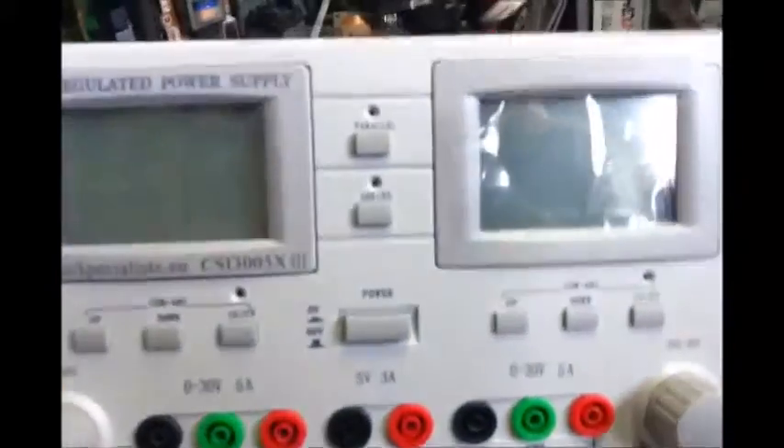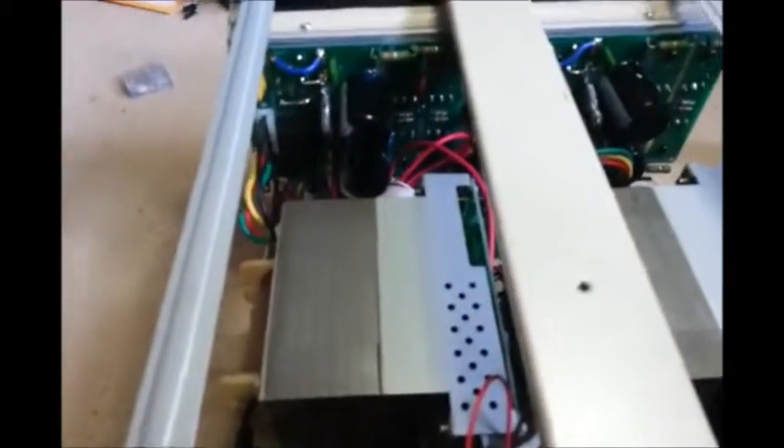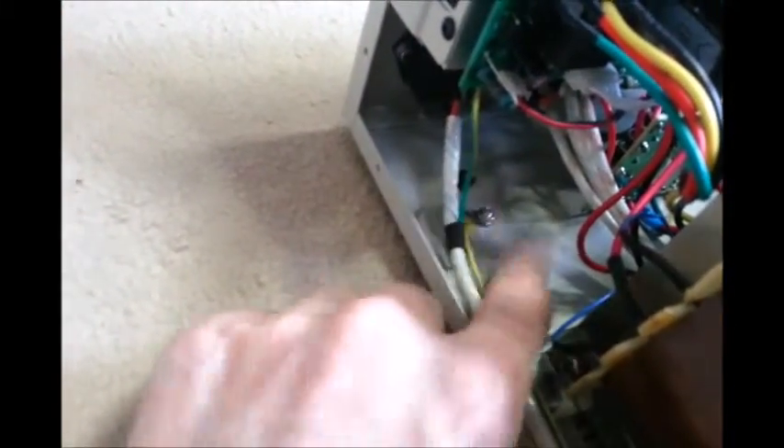So there's the inside. I do believe these are not just made for circuit specialists — I'm pretty sure I've seen the insides of one of these before on a different brand name. When I opened it up it looked quite familiar, and I'd seen a teardown of one of these single 5-amp units and it seemed like it did okay, considering it comes out of China. Not everything that comes out of China is that great or safe. But it's got a springy-type washer to make sure the earth stays there, it's got heat shielding, and like I said it's got these big-boy transformers.